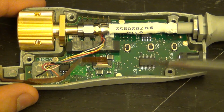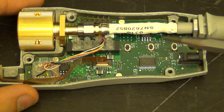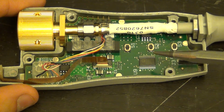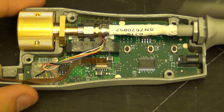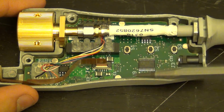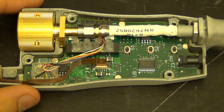So this might actually be a DAC, I have to look, and that way you can put in any common mode voltage that you like on the input of the probe in order to make it compatible with the voltage that is on the bus, so that you don't have current being drawn in and out and so on. You can compensate for DC voltages that you're trying to measure.